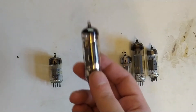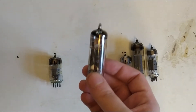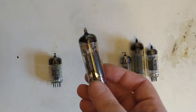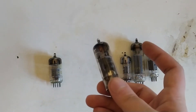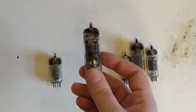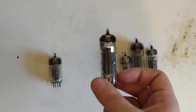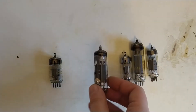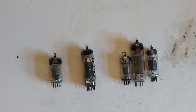Because you want a worn-out but still functional tube — no shorts or damage. First of all, if you destroy it, you lost a tube you can't really use anyway. And also, it tests your circuit for robustness, because you want your circuits to still work fine if your tube goes down to like 70% emissions. A vacuum tube circuit that's really dependent on an extremely strong tube is not a good circuit, because they are going to degrade over time anyway.